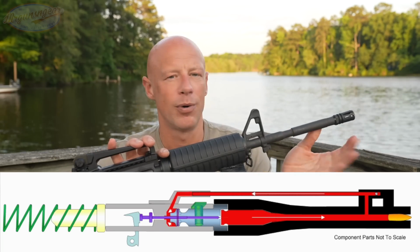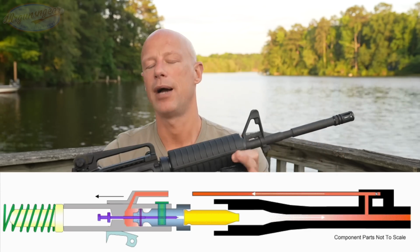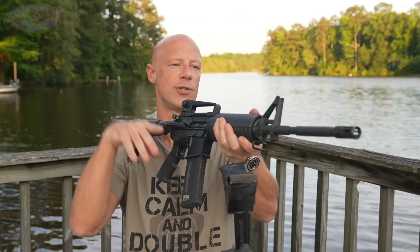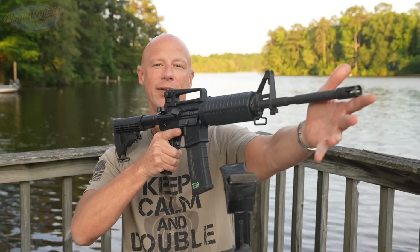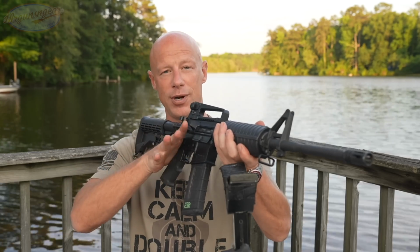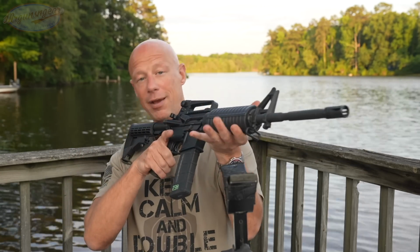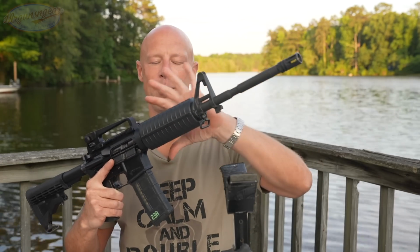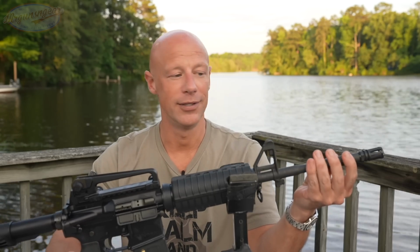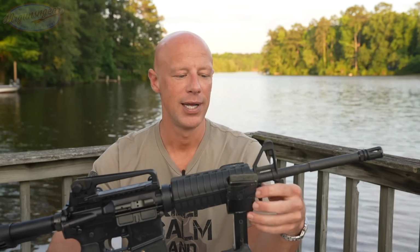And then you want a thinner profile out here at the end, because number one, there's less heat at the end, but additionally, if you think about how you hold a rifle when you're firing, it's just geometry and physics, right? The more weight you have out here at the end, the heavier it feels, versus if you have weight back here, in terms of how it feels when you're actually shooting it, the balance of the rifle, the pointability of the rifle, how heavy it feels, all those things, you want your weight back here. It balances much better. And out here, it literally does absolutely no good on the end. It makes no sense. It just adds weight where you don't want it.